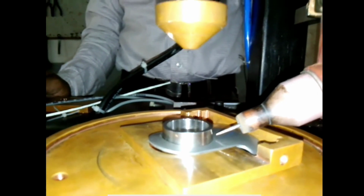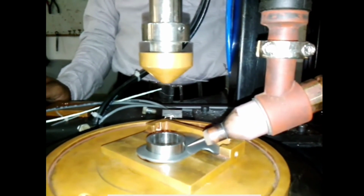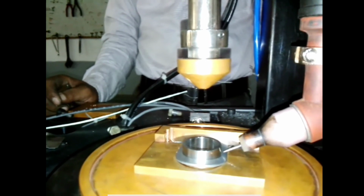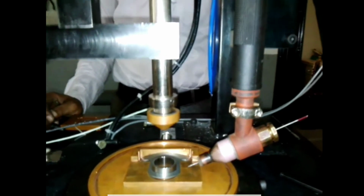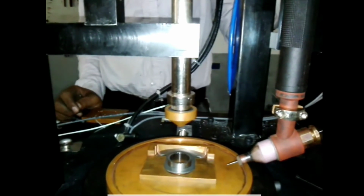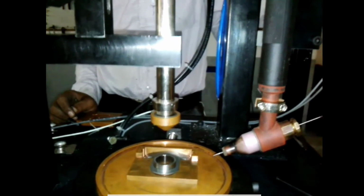Here we mentioned the dip because the component is only one. If you have a plethora of components, about 10-20, then we can give you an inbuilt sequence where you can just set the major dia, that is the external component, and the minor dia, that's the internal component, and the system can automatically detect the curvature. Now this is the testing video. So basically not much of a welding that you can see here. You can also see a simple spring-based clamper to clamp the component prior to pre-tacking.